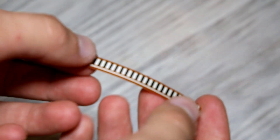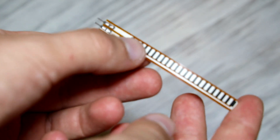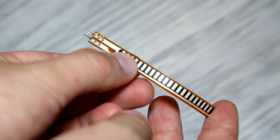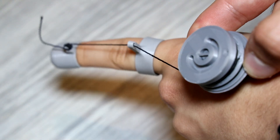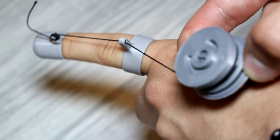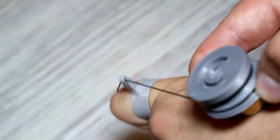There are lots of different ways we could try to track the fingers, but the most commonly used for this kind of application is flex sensors. The problem with these is they're extremely expensive — about $10 each, so that would be a hundred or more for the whole hand. So I decided to go with the simplest approach possible: pulling string. This solution is super cheap because we can use mechanical parts to measure how far the string is pulled, and when we add haptics the string can pull back on your fingers to make you feel everything you're holding.